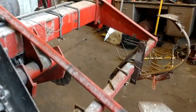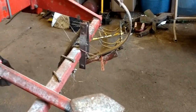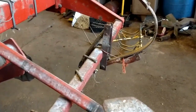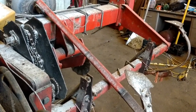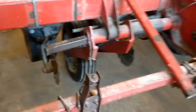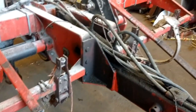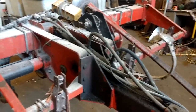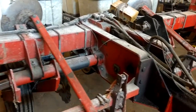I really don't want to make any bigger furrow than necessary with my seed markers. I should probably take these field cultivator teeth off too — that was an experiment we tried once that didn't yield any real benefit. Oh, here's my other marker piece right here — I put it in the axle. I don't put those in until I'm ready to plant because when they're tall like that, they won't fit through the lean-to door where I store it.